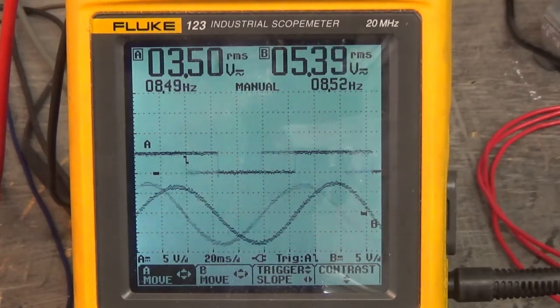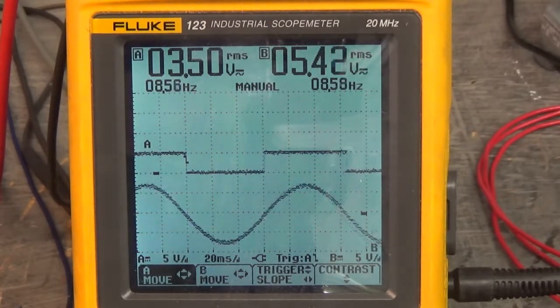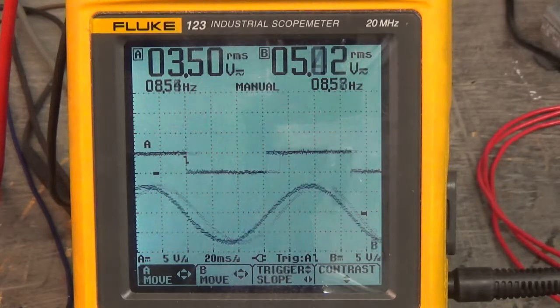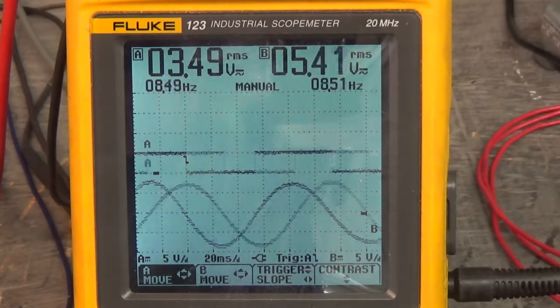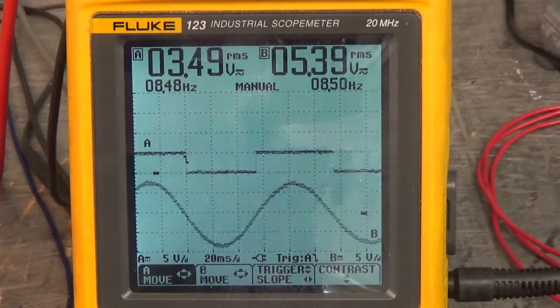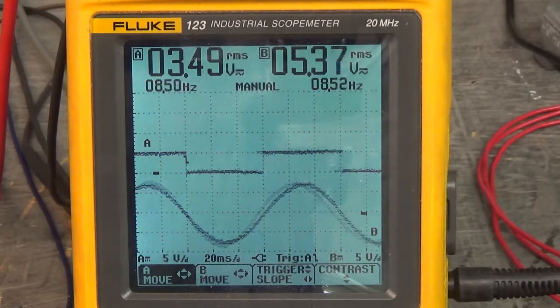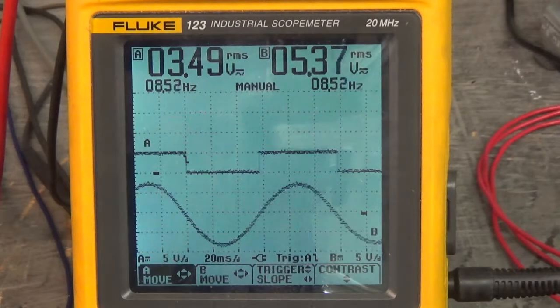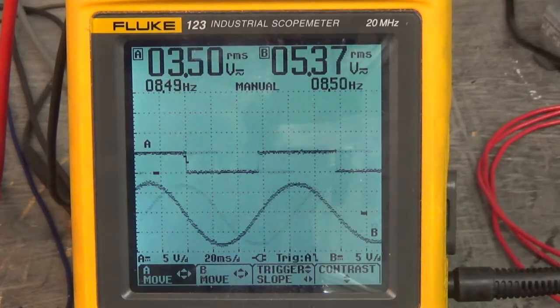So when we pull, I'm going to look at the Hall effects in relation to U and W and V and W. But for now, when we install that new feedback unit in this servo motor, this is what we're going to time it against. I need to look at the other waveforms of U and W and V and W in relation to the Hall effects to make sure that I can get it all looking the same.